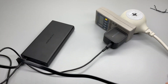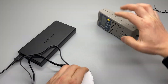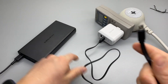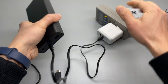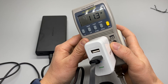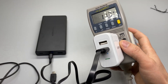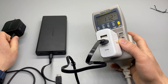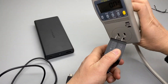This power bank also takes a micro USB input, so I'm going to test that as well with an Anker charger — that one is about 24 watts, the traditional Type-A to micro USB. It is 11.4 watts; it's taking about 10 watts of power to the power bank. Type-C charging is a better option — three times faster.